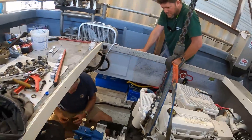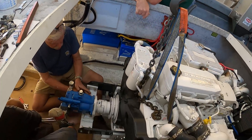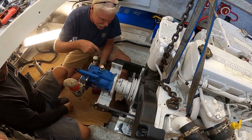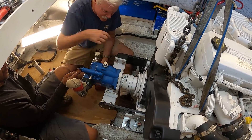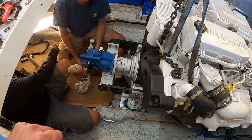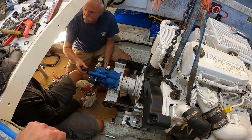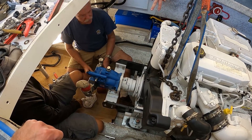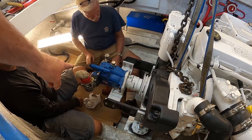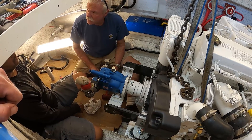Tell me what we're doing here, Corey. Looks like we're installing the hydraulic pump on the front of the engine. The bracketry was here but had to be modified. This is new — the Lovejoy is new. The other one was a clutch. So you had to modify the brackets to remove the clutch — this bracket used to come out all the way out to there. Same pump though. We just took out the intermediate Logan oil clutch.